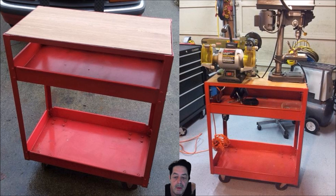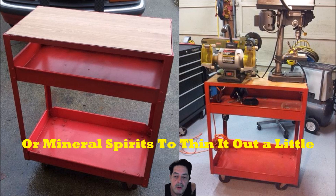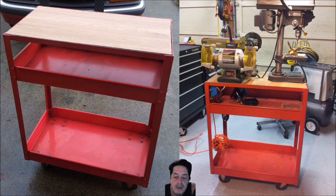There's another way to finish it — on some of my bench tops I use linseed oil, just coat it to keep things from sticking. It's easy to maintain: every six to eight months or so, thin the linseed oil a little with paint thinner, do a wash coat over the top, and it keeps the surface looking nice and prevents the wood from warping or splitting. Over on the far right, you can see he put his drill press and grinder on there — it made a nice portable station. He put a hole in the middle for his cords to go through.